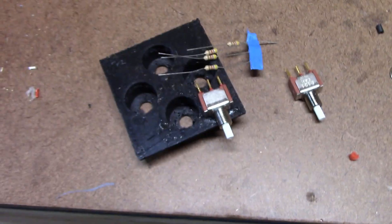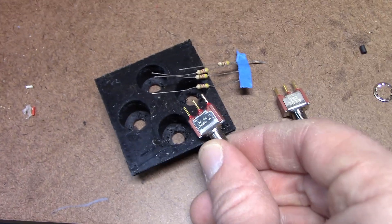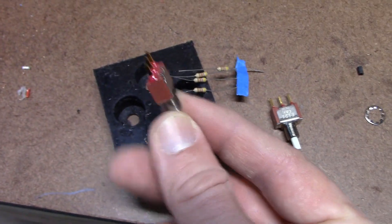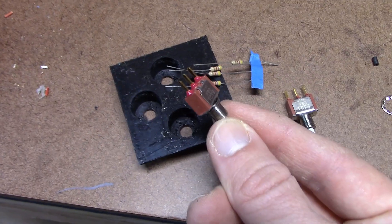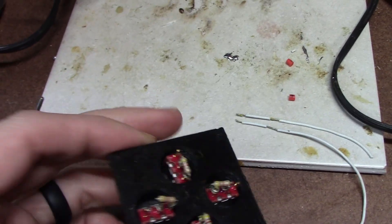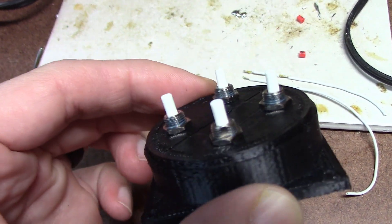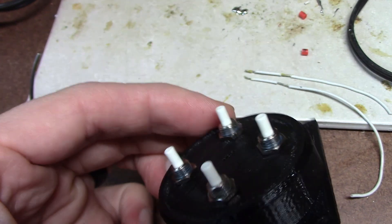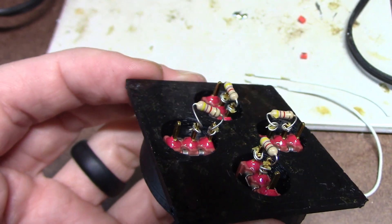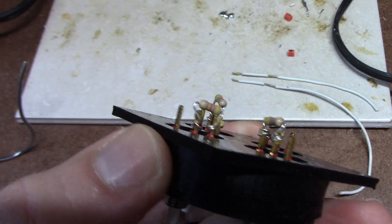From the radio's perspective, when the voltage is equal with neither button depressed, that simulates a neutral position. Pushing one button or the other simulates a 100% signal in either direction. When installing the buttons, make sure the common pin, which is on the right, is towards the middle — that makes the wiring easier. I mounted the switches, put some Loctite so they don't loosen up, and then wrapped the resistors around the pegs and put a little flux on there.